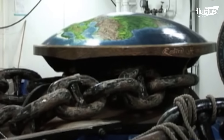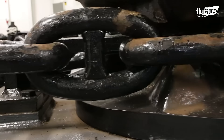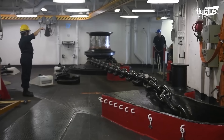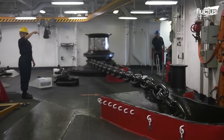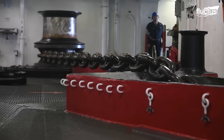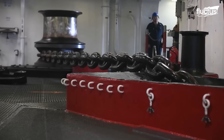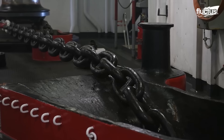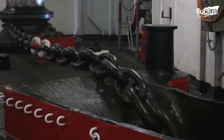In each room, a large winch known as a windlass controls the dropping and hoisting of the anchor as it turns. In order to grip the anchor, it is equipped with special drums known as wildcats. These also act as a braking system when the anchor is dropped.